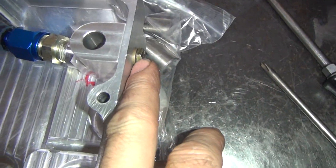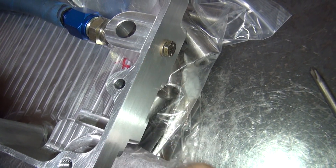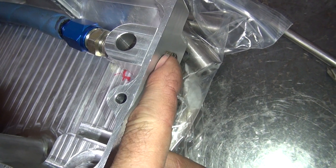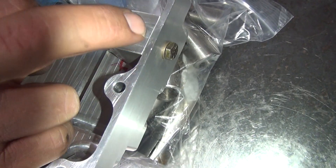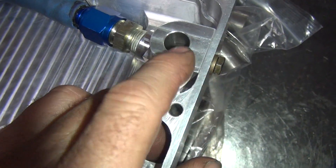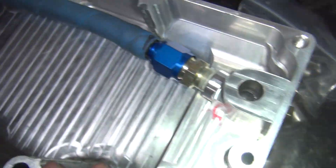We're taking up 200 thousandths of that quarter inch — quarter inch after. He has an O-ring under the washer. That means it can still leak underneath the bolt. No — there's an O-ring underneath, on the inside wall of this, sitting against the outside wall. So it'll be a sealed surface. You've got the O-ring between this and the wall here, so the bolts can be completely dry. That's a big improvement on that piece.